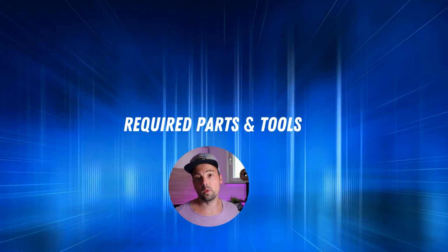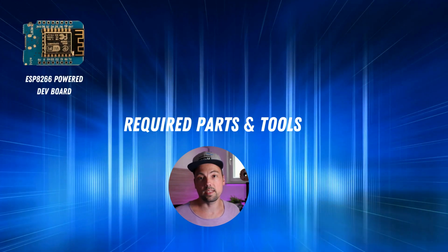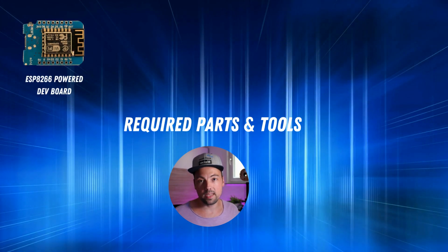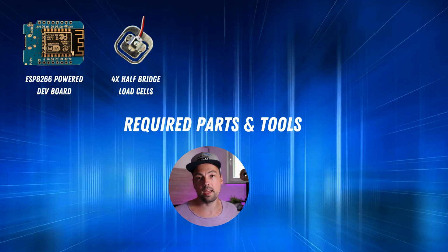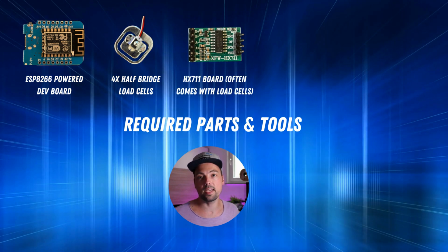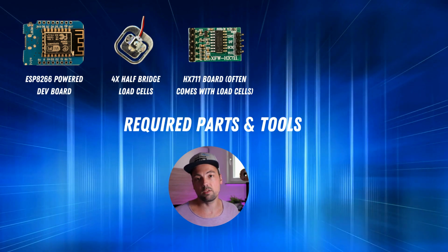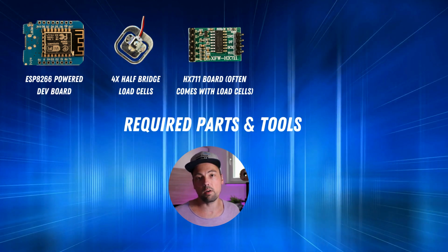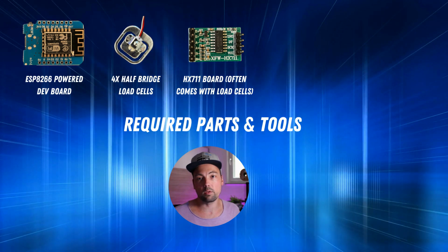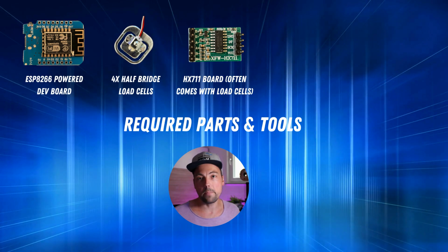Okay, so what do we need for this project? First of all, we need an ESP8266 powered D1 Mini. Then we need 4 half-bridge load cells and also an HX711 PCB. This is a little PCB that usually comes already with the load cells and it is used for reading them out and transforming the value to something that you can read out with the D1 Mini.